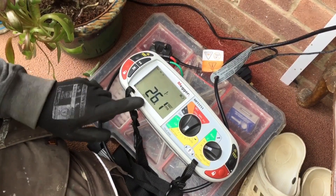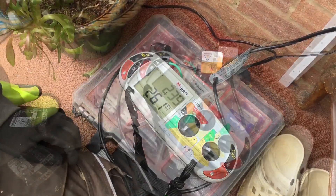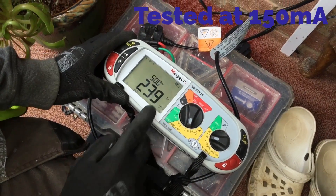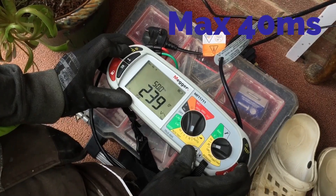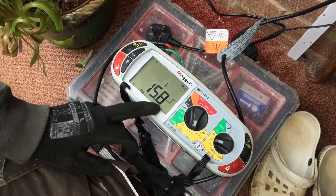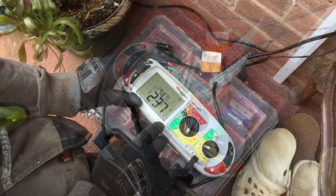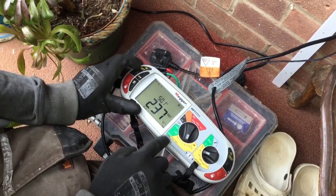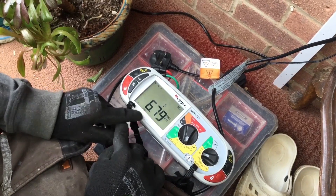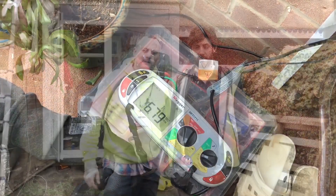Now at five times its rated value at zero degrees, hoping for less than 40 milliseconds — it came in at 15.8 milliseconds. After resetting the RCD I tested at 180 degrees and took the highest of the two readings — that was 6.79 milliseconds. Big thanks to Jack; if this is looking easy, this is take 46 of trying to do the exit to this video — we're getting there!